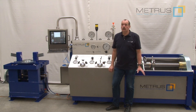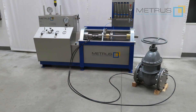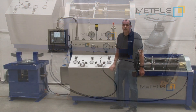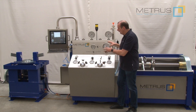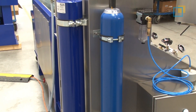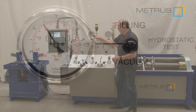If you would like to test also shutoff and control valves with bigger diameters, you still can use our so-called external test adapter with blind flanges to do so. This combined solution allows us to use the sources integrated in the control panel — like high pressure water pump, high pressure gas accumulator, bladder accumulator, vacuum system, and so on — for both units.